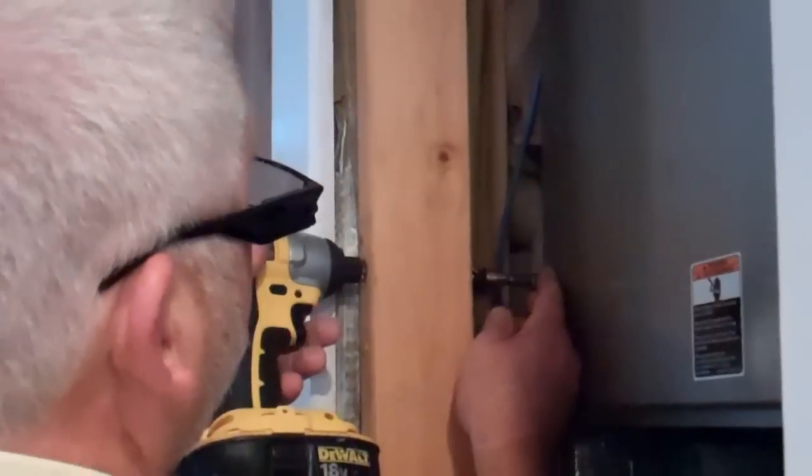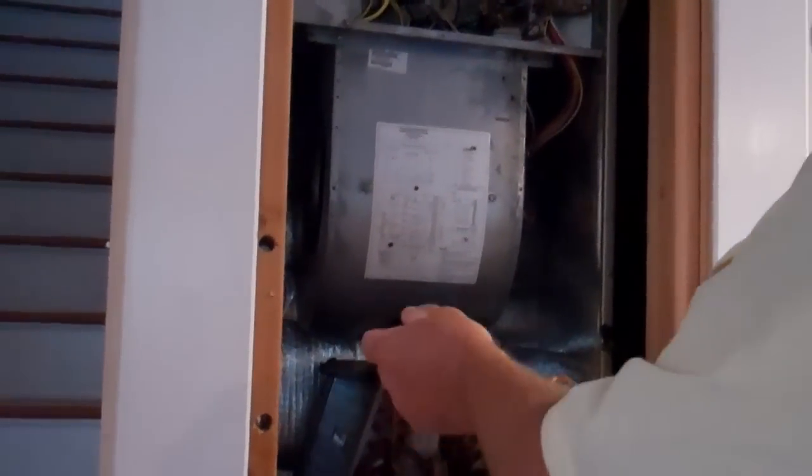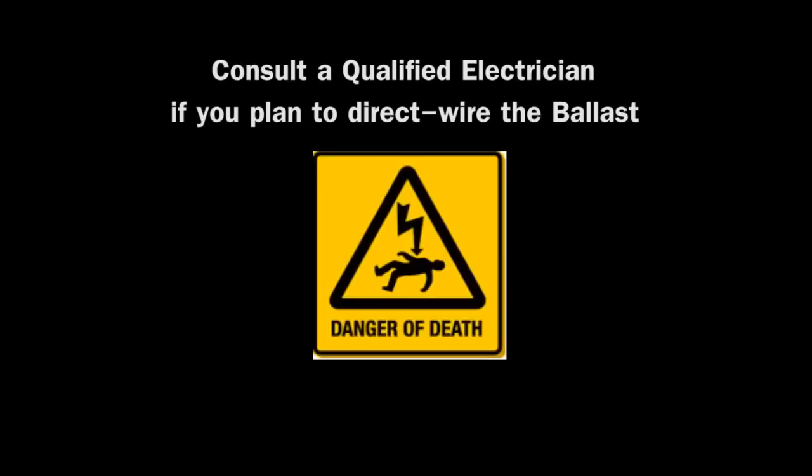Go ahead and take off the top panel. If you don't have a meter, you probably shouldn't be doing this, because you need to know how to operate a meter. We actually have a 60-amp breaker and another 60 — these are probably for the heat strips: one for the main air conditioner, one for the heat strips. So we're going to look for a leg off each one.